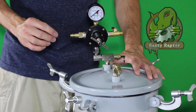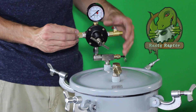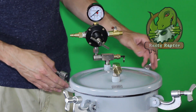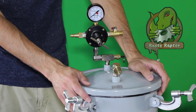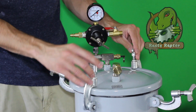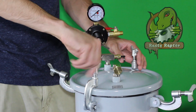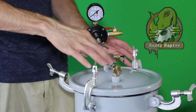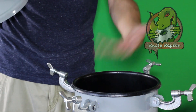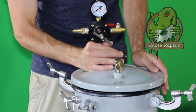When you're using this, you're gonna hook your airline onto here. Watch your gauge, get the pressure to 50 in the tank, and let it sit for a while — let the resin go. When you're done, pop this valve on the side over here to let all the air out. You can undo these clamps, which will be tightened down like this. Pop those off, open it up, reach in and pull your item out, and you should have a nice clear casting.